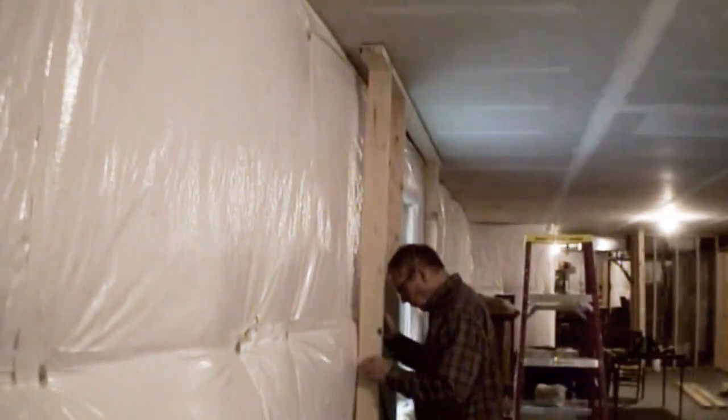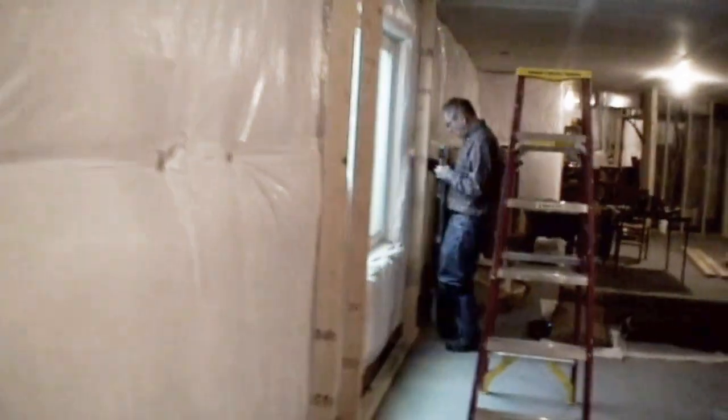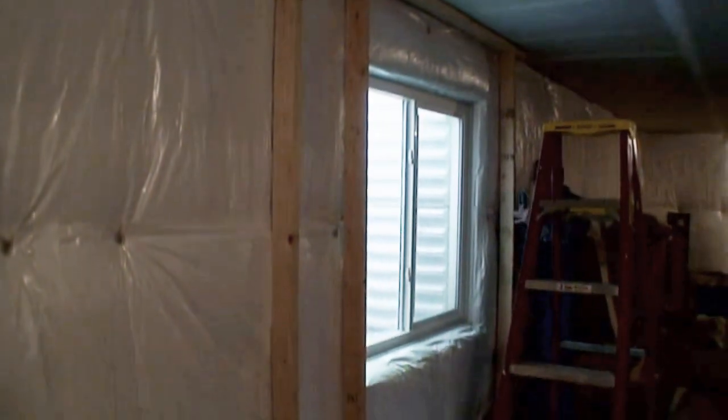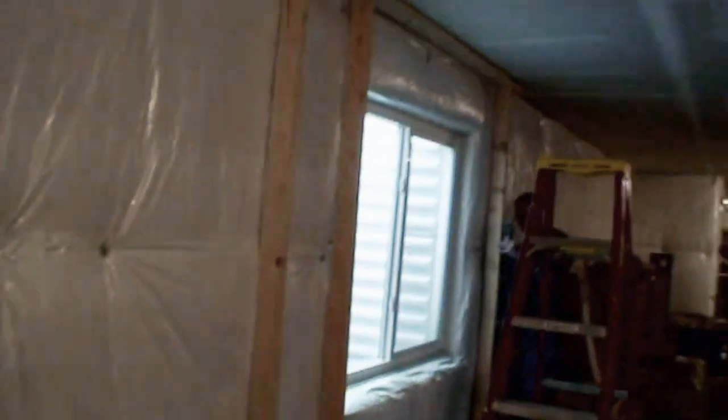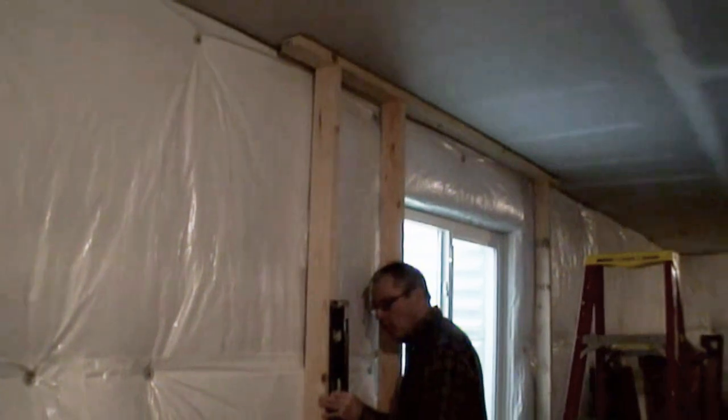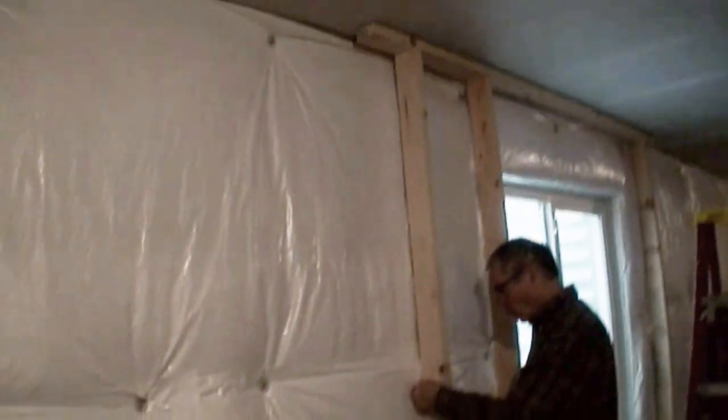So this whole process here is a judgment call, really. As you just heard Tom say, the factors he's considering are, number one, that wherever that thing gets nailed in place, it defines where the rest of the wall sections will go along here. And wherever that is, will create a gap that has to be filled with foam or some agent to block airflow, called a fire block. So that's what he's balancing here.